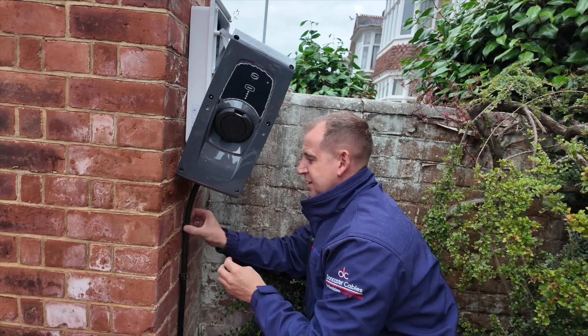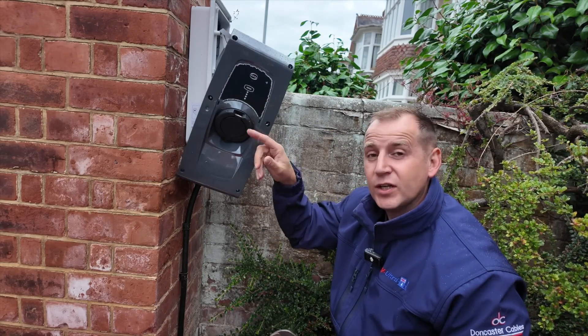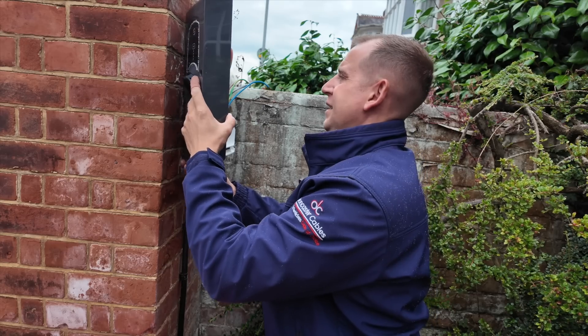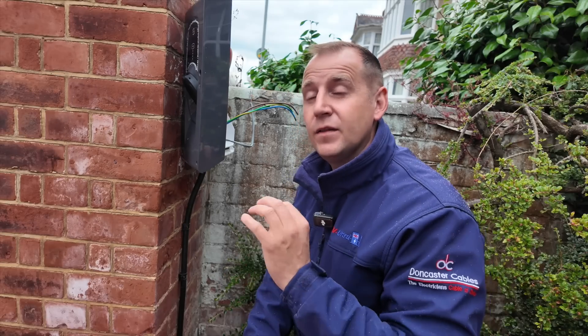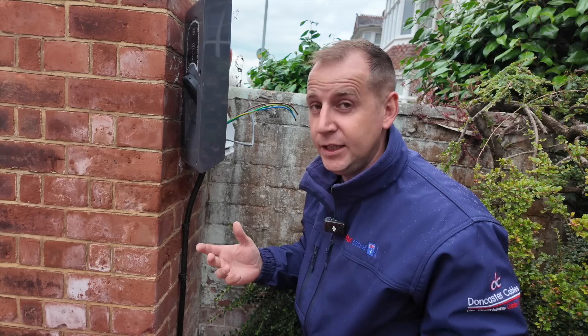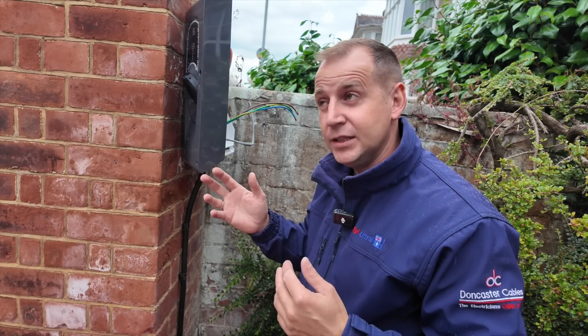The socket is pre-wired so you can't take the front cover off — you've just got to put up with it hanging about, but you can wedge it in. It's whether I've left my cores long enough to follow their routing or not, and that's the thing to watch out for. When installing chargers, never make the cables as short as possible — give them some length. If you end up in a situation like this you may need that extra length if they've moved the terminals.